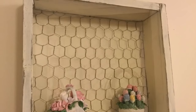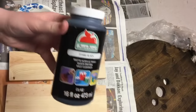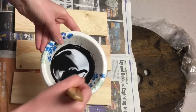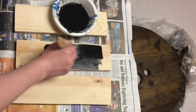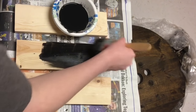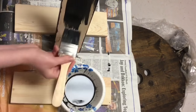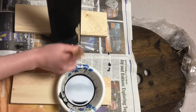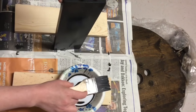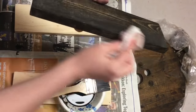Next I have this box shelf that I made. I am no expert with building things but I thought this was pretty simple so I gave it a try — if you know a better way please leave me some tips in the comments. First I was just mixing up some black Apple Barrel paint with some water and putting that onto these boards with my paint brush and wiping it off with a paper towel. This leaves kind of a stained effect, and I'm going to paint over that with white chalk paint once it's dry so that when I sand to distress it later it will have a little bit of black coming up from underneath, giving it an older look.